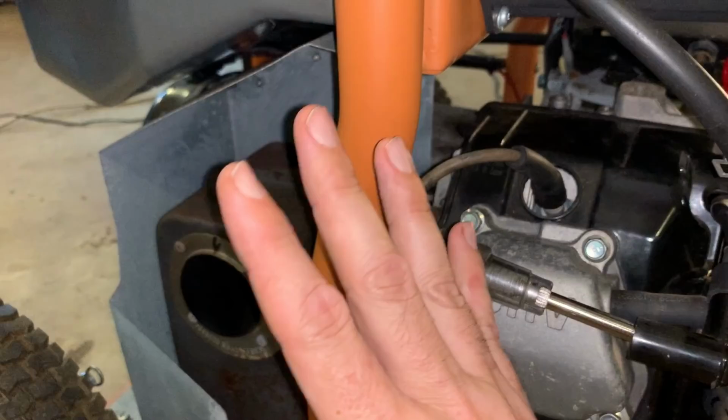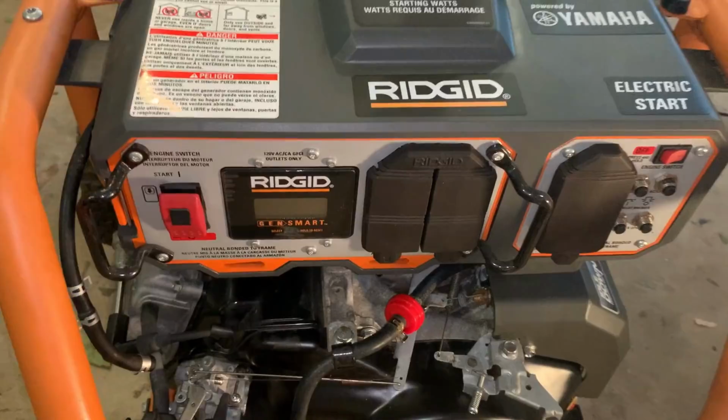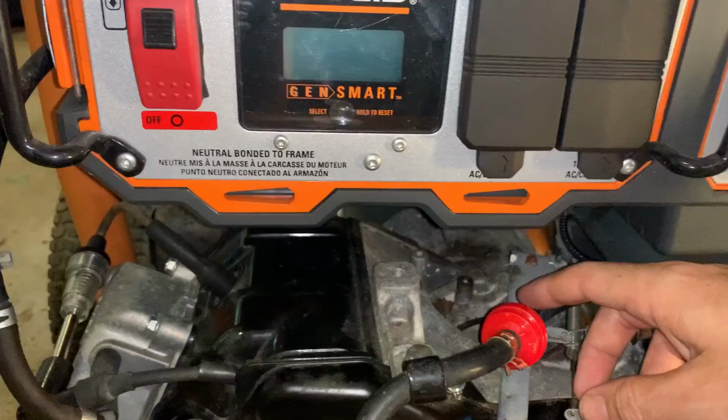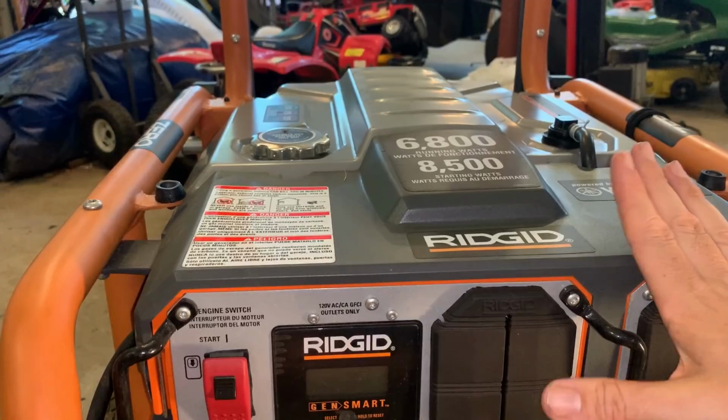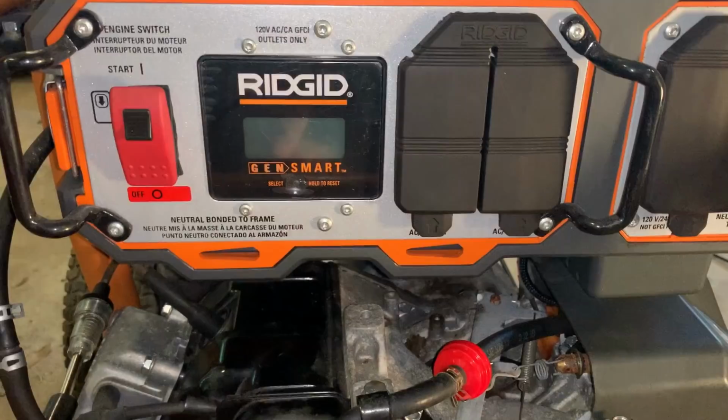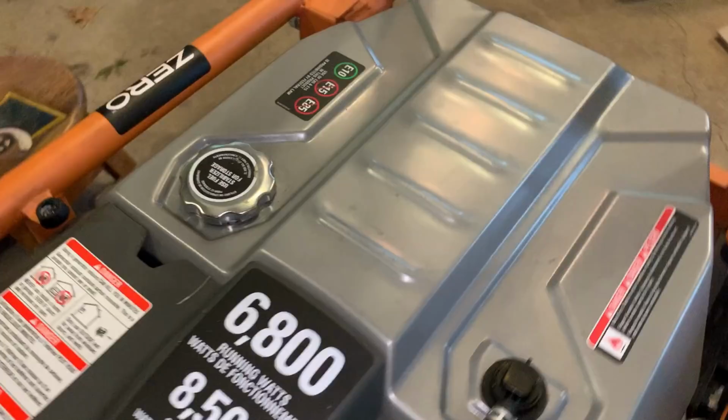It's just the fact that it's a hot day. It was 85 degrees Fahrenheit. We have ethanol fuel, 10%, which lowers the boiling point. And I guess the last thing is the gas that's in here my neighbor put in. I don't know anything about it, but there's different blends where I live. There's a winter blend and a summer blend. If he put a winter blend in there, then that also increases the likelihood of vapor lock. So there's a number of possibilities here that could be causing this issue.